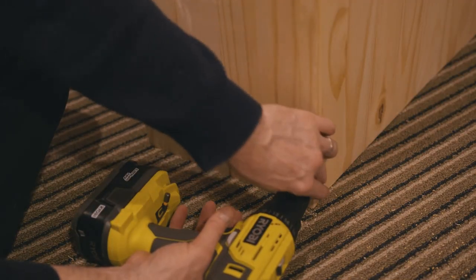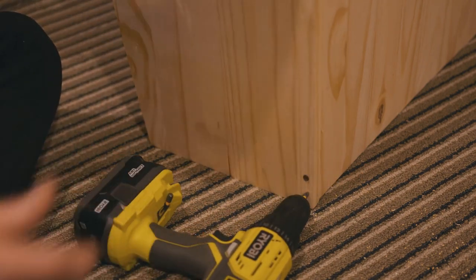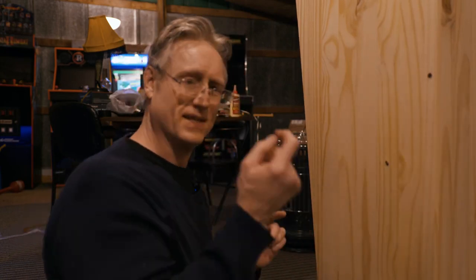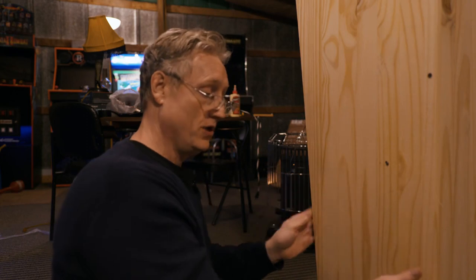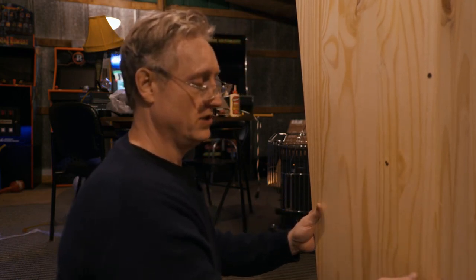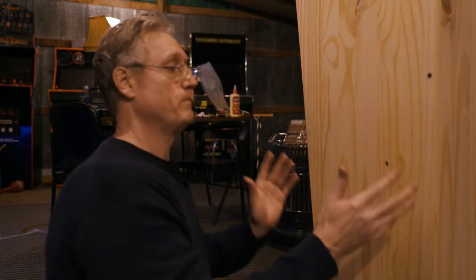Be careful you don't over-tighten here — I'm just barely tapping it. Get a screwdriver if you have any doubt. I'm going to put in another two screws, then back it out. I have all four screws in now and it's nice and flush. I just have my little lip here matching the lip on the other side. I want to save as much room in here as I can for the monitor, the solenoids, and airflow around that monitor. I'm going to back out the screws, pull it away, put a nice bead of wood glue on, put it back, screw it back in, and then move on to the front and back pieces. Then this part of the build — the initial box — is done.